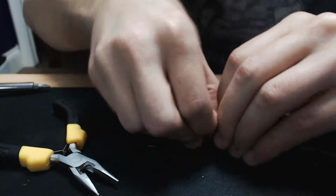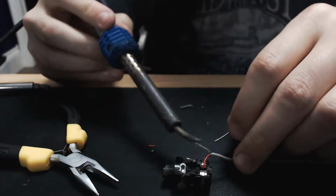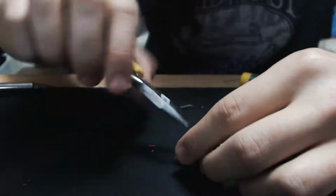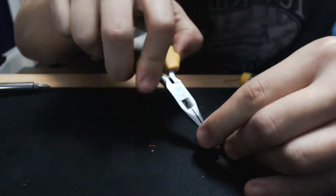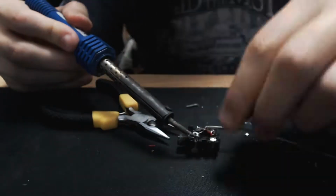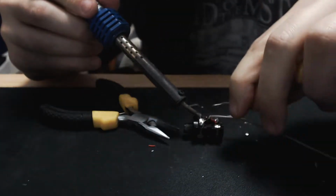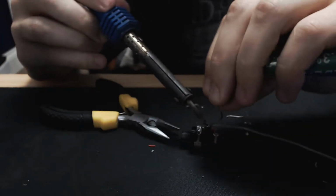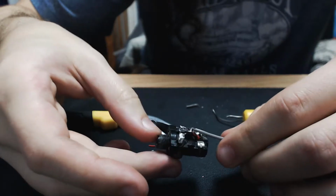We did discover that there was a bit of a loose leg on one of the tone pots, the pot for the middle pickup I believe it was, and I tried my best to get that working but couldn't get it working reliably. I just temporarily tacked in another 500k pot of another size, which did seem to improve that, but unfortunately there were still some intermittency issues, mainly around the selector switch and the other pot.